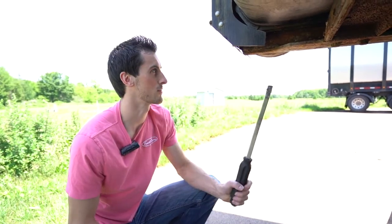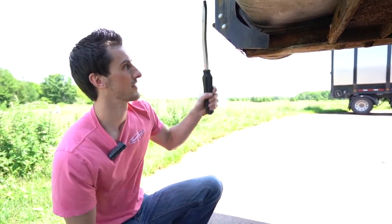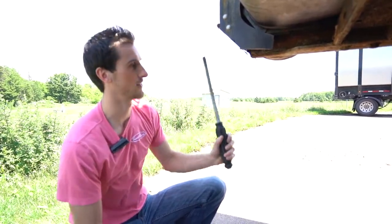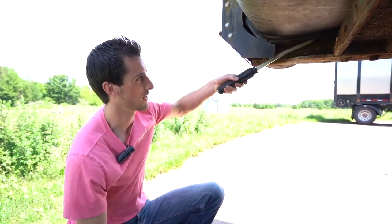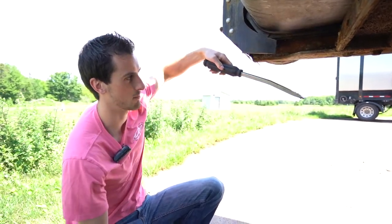The second method is to come to the rear of the trailer and watch the chain as you're unloading. As the conveyor goes around, the highest point of strain would be right above the motor, right above the shaft as it comes around, because that's where most of the pulling power is coming from. That would mean the least strain would be right here, which means that if there's any slack, this will actually dip down before being sucked back up into the conveyor track.